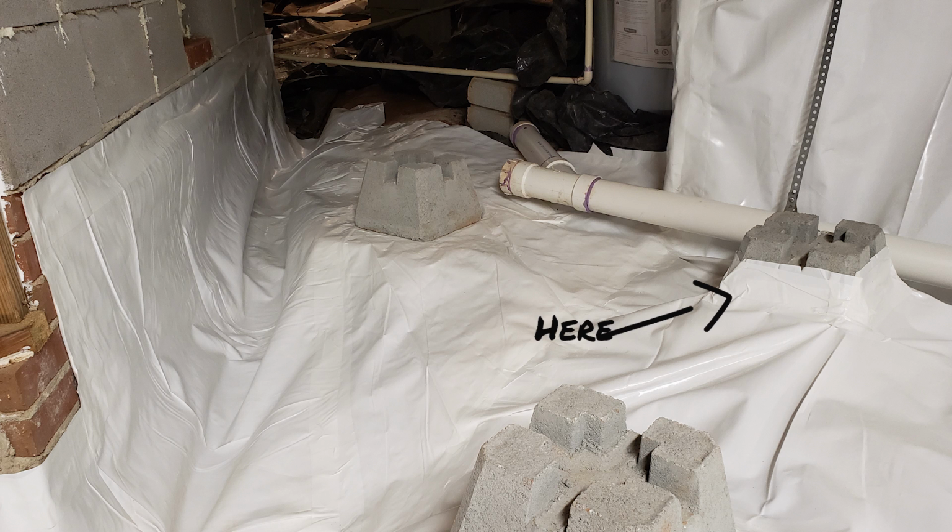Well, it looks like some of your footers, the decking footers, you covered in the vapor barrier, which, for those of you that don't know, if you touch wood to cinder block that's touching the ground, it's supposed to be pressure treated. If you're going to create the sill plate, for example, it's pressure treated, the only piece of pressure treated wood in the whole crawl space. And that's the wood that separates the block from the rest of the framing. So if you're going to do this, make sure that your decking posts use a pressure treated piece of wood, or you do like Dwellin did and you cover it with vapor barrier. Because if you did that, you could use what I call green wood, non-pressure treated wood, at that point.